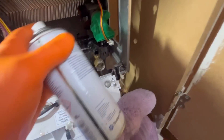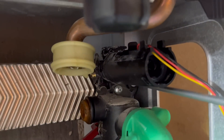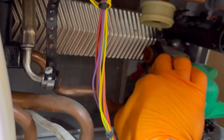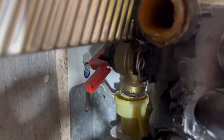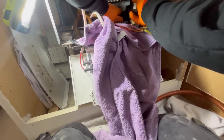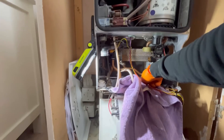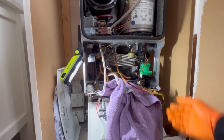Once we get the PRV out and plate disconnected - this screw here is your plate securing nut, and you've got another screw just to the side of that which holds the block to the chassis of the boiler. Pull that clip out. You would normally have to pull down on that yellow clip to release the PRV from its holder, but as you can see it's never been put in properly in the first place - you can see the o-ring. We're now wrestling with the bypass pipe, trying to push and twist it as far right as possible.